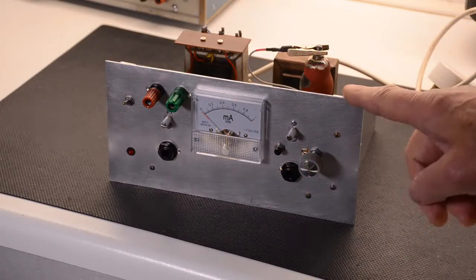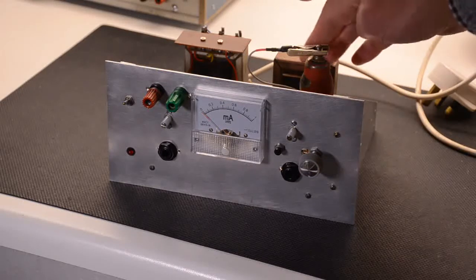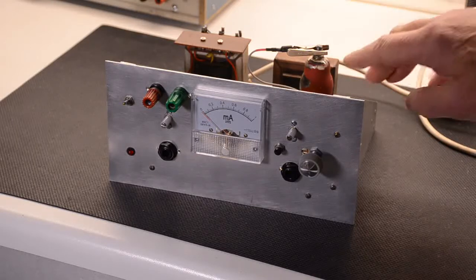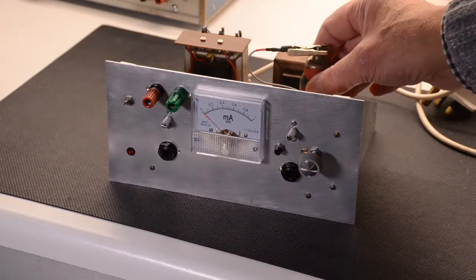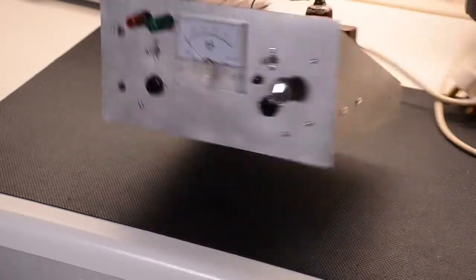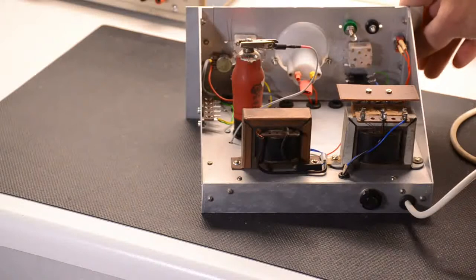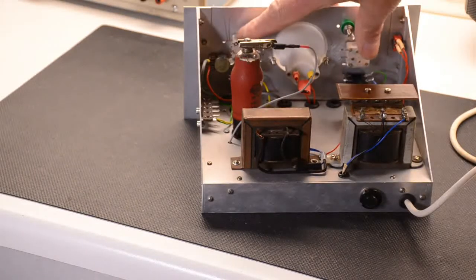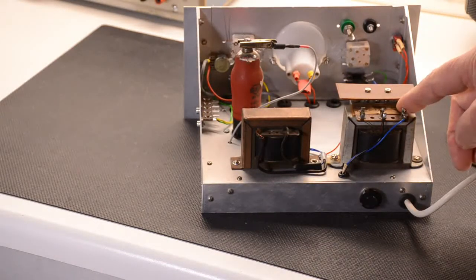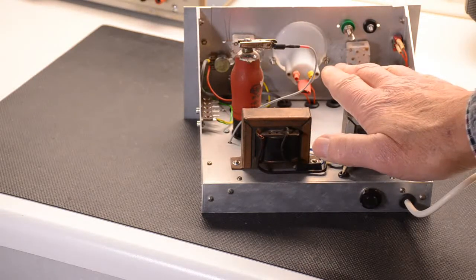Remember, this circuit is a simple one valve amplifier. You can't drive a loudspeaker directly from this, so we won't be using the output transformer — the loudspeaker transformer. This is in fact an RF valve; it's for radio frequencies mainly but it works fine for audio frequencies as well. If we turn around we'll have a look at the other side. Inside there's not a lot to see on the surface. Note the tuning capacitors obviously aren't connected up. We are of course using the 6.3 volt heater transformer. Note the piece of paxolin on the top to protect against accidentally touching the mains wires.